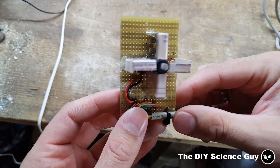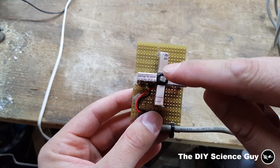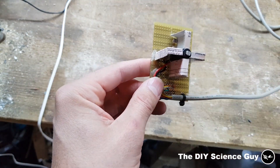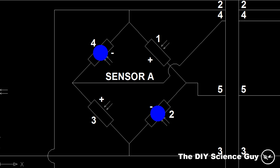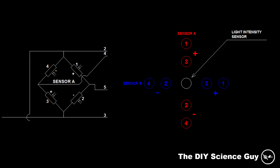Now this sensor consists of eight photoresistors, as you can see. And this photoresistor in the middle is for voltage control, which I will explain later. Because of these pieces of cardboard with which I have covered them, it will always have a shadow on one side. So now there's light shining on this side, with a shadow on that side. What you see here in the diagram is a Wheatstone bridge. So if these two photoresistors are in the shadow and the other two are lit by the sun, then you get a difference in resistance between the two, and therefore you get a potential difference. They are paired to one side.